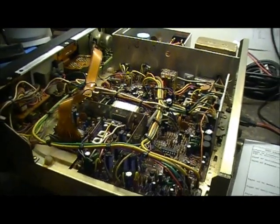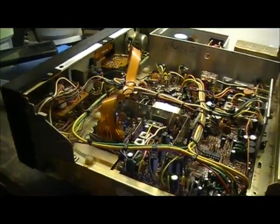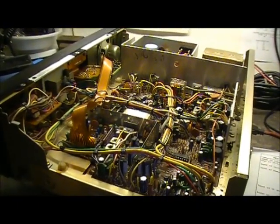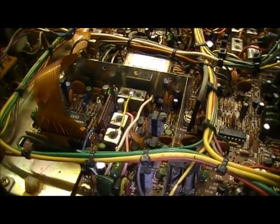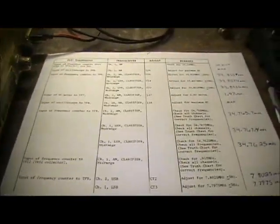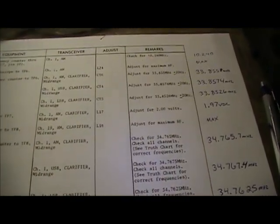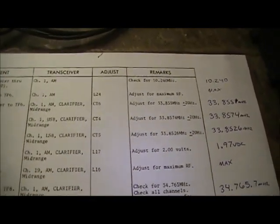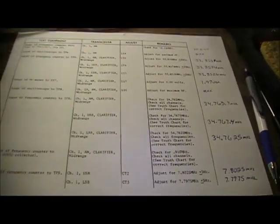I was already talking to the owner about it and he decided to just go with retuning the receiver. So I went through the tuning stages according to the service manual and I printed off this sheet — this goes through the alignment for the receiver — and I've come up with all the readings. I got a bunch of pictures to put on it.